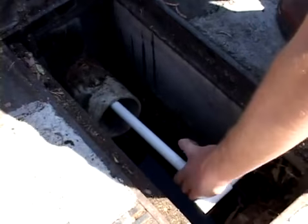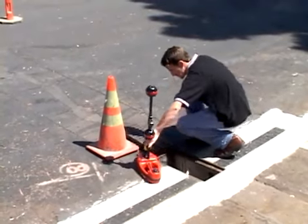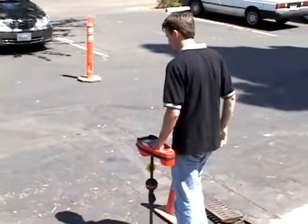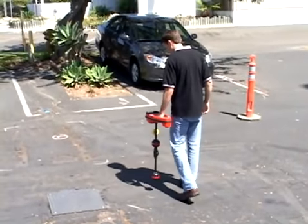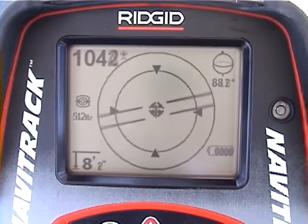Once the sonde is in position, we'll rotate the PVC pipe so that the sonde is tilted approximately 45 degrees from horizontal. If you know your sonde is tilted, your best bet is to locate it using just the signal strength as we demonstrated in our first example. But let's assume that you don't know the sonde is tilted and locate it using the map.